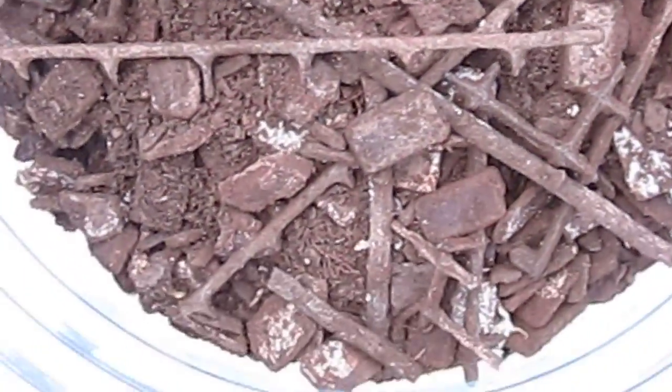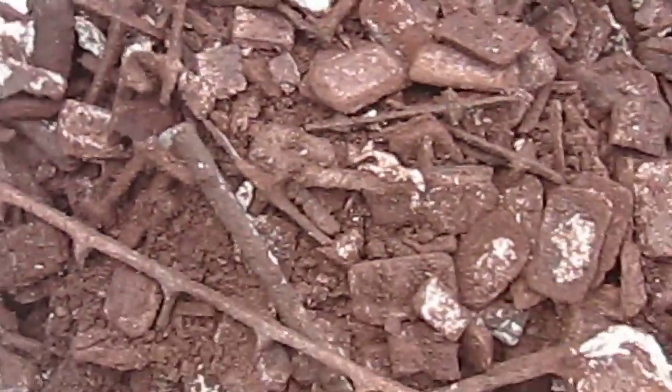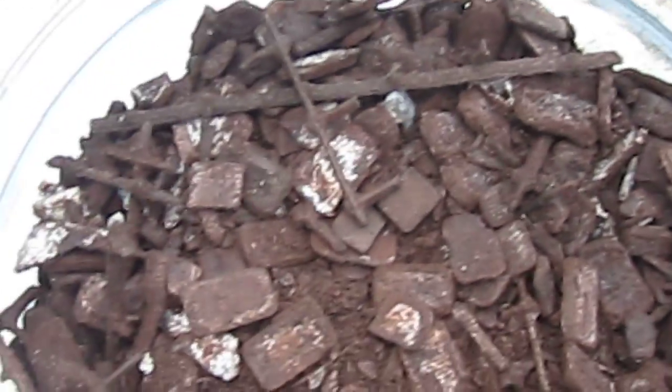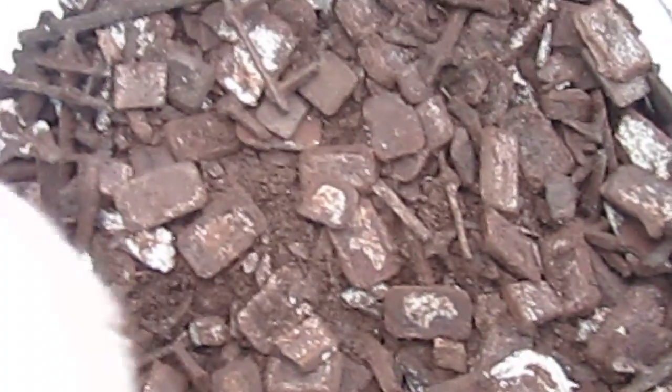Now this stuff's not too cheap. I want to basically rebuild some batteries and I have all this red lead here to use. What I'm going to have to do is get it back into a powder form, remove all the bigger stuff — which is lead itself — and these little square pieces, which is the part that's pressed into the grid, that's actually the red lead. It comes in a powder and it needs to be mixed with sulfuric acid to be like a paste — like a thick mud basically — just a pasty texture, and then it gets pressed into the grid plate.